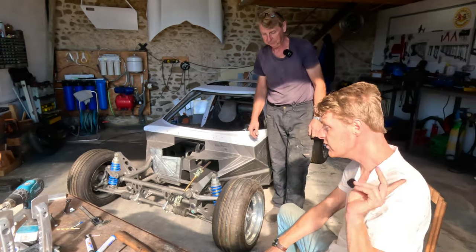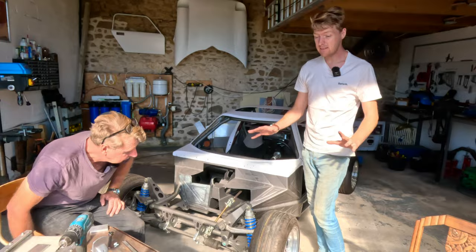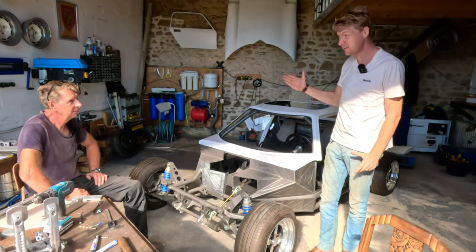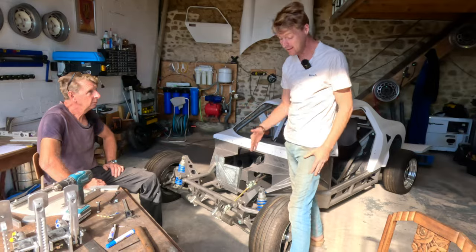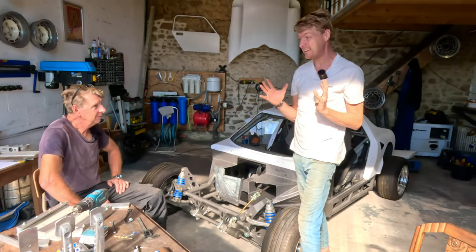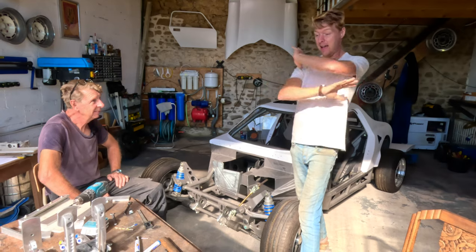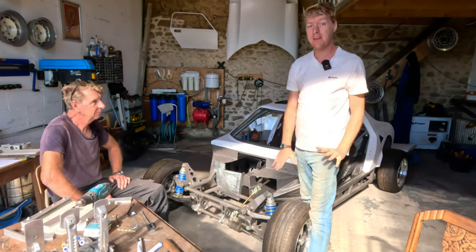And not only that, you'll find that a lot of air, tyres, in fact, this is my biggest pet peeve with 98% of the cars that you're going to see at SEMA this year and that you saw at SEMA last year. There's a trend of putting a diffuser on the front of a car that empties right into your front tyre. And it drives me insane. I want to grab the people who are designing these body kits and shake them, because a tyre is a parachute. That's what it is. A tyre is the worst dragging thing in your car.